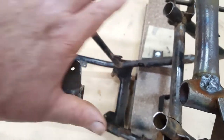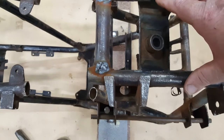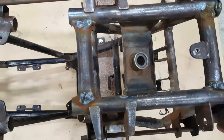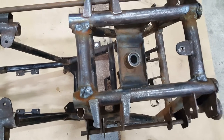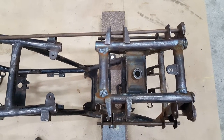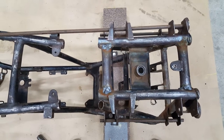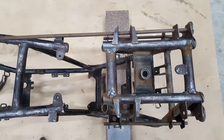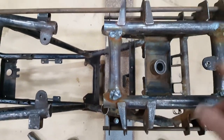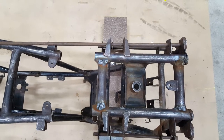Then I'll try to address this section being still slightly out — it may require another couple of cuts just below those brackets to get a bit of movement in the tube. The tube itself just doesn't want to bend at all while in full section. I'm cutting it back to three quarters of the way through to get it to bend, and it bends quite successfully. I'm doing a repair weld over where I've cut — basically tacked back — and I'm getting somewhere slowly.